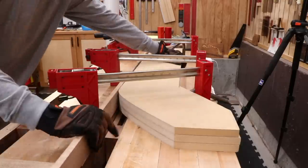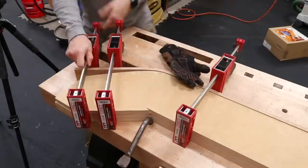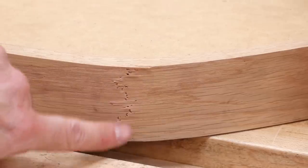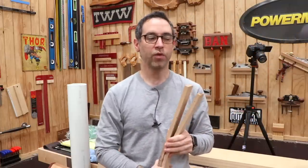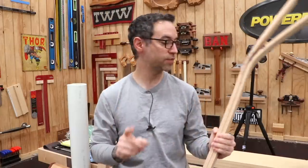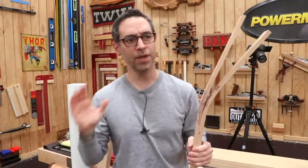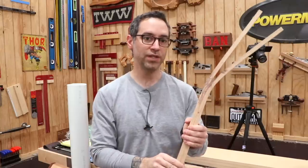On the second bend I went it alone, which was a really dumb idea — it took way too long and the results were no good. We definitely have our first failures: a lot of checking in the first piece and an outright split in the second. We need to think about why this happened. The wood is always an X factor, but the key difference between these pieces and my practice pieces is the soak time. These got less than 24 hours — just an overnight soak. The other pieces, not intentionally, soaked for about three days, and with kiln-dried stock I think that's making a difference.